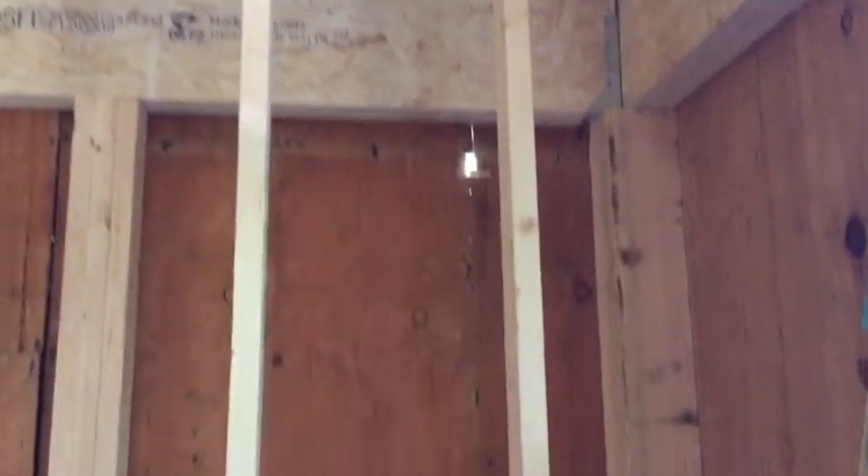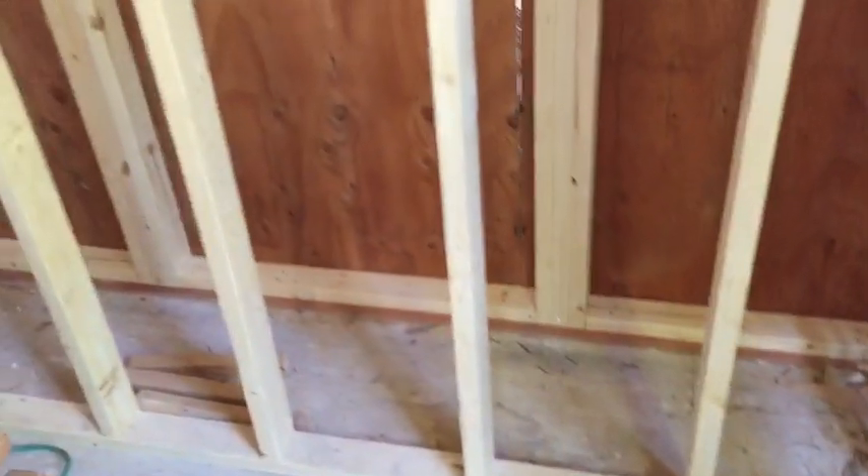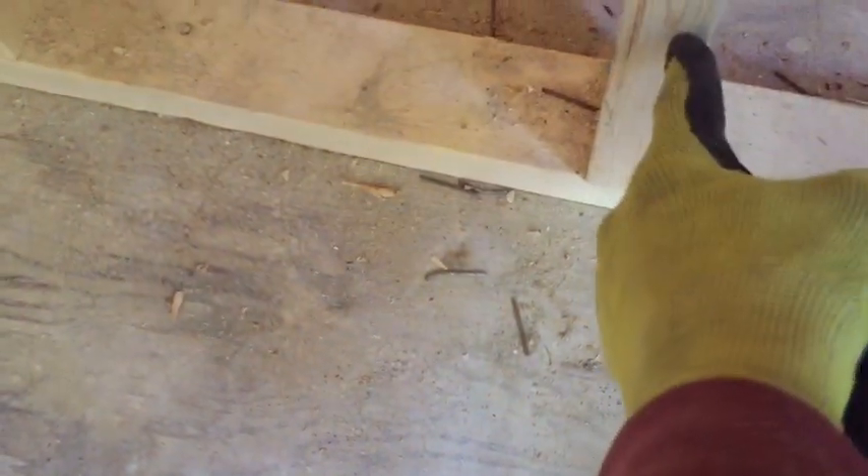You find your joist layout — your floor joist — and you put your top plate and bottom plate. You frame it exactly like an outside wall. There's an example for you when you're looking at it when the drywall is removed. You put your studs on the joist, find the nail holes, find the layout, and that's where you set your studs.